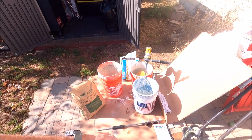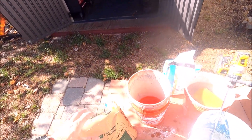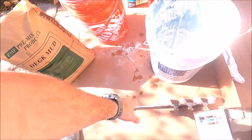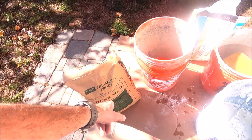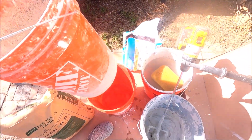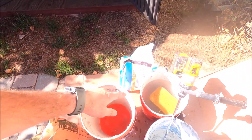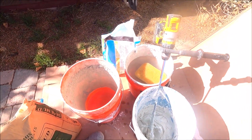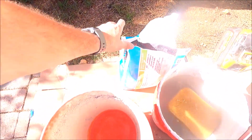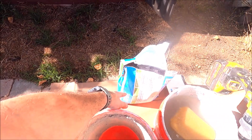All right, guys, have everything set up right here under the cardboard to protect, obviously, the backyard. Our auger bit for our dry pack mortar bed. Our double bucket method so that we can mix a lot more than a single bucket. Mixing up some thinset right now. We're gonna trowel on some thinset before we drop down our dry pack, and we are using Tri-Lite by Laticrete